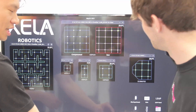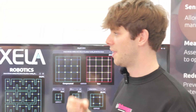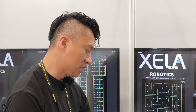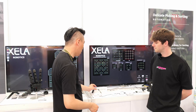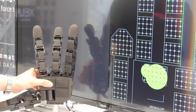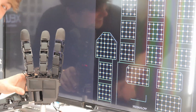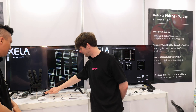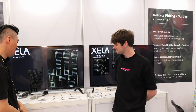We're talking about interference between different magnetic taxels. These don't just come in a one-by-one — theoretically you could make any size or shape that you want. We also have flexible ones, so you can make curved fingertips. This hand, for instance, has 368 sensing points in just one single hand, and it only uses two CAN buses. So 368 different sensors and only eight wires combined. We try to make it very convenient because you can just daisy chain everything.